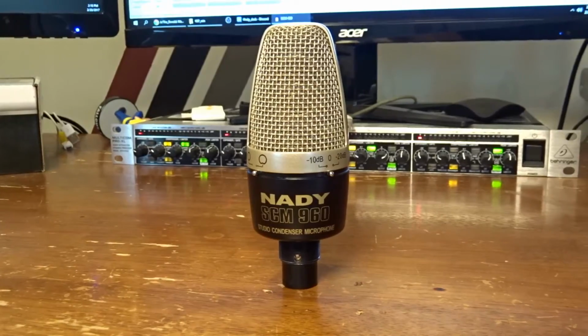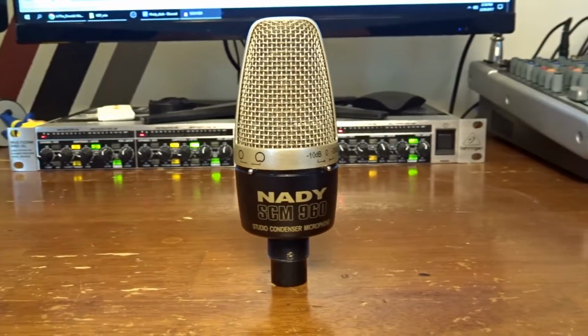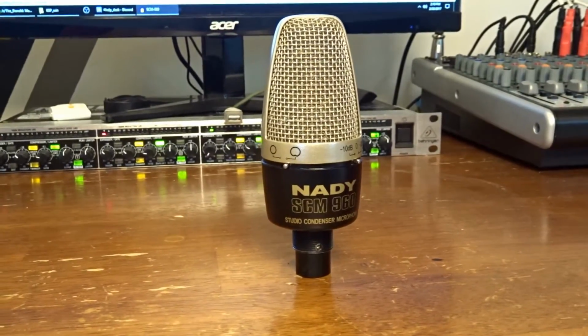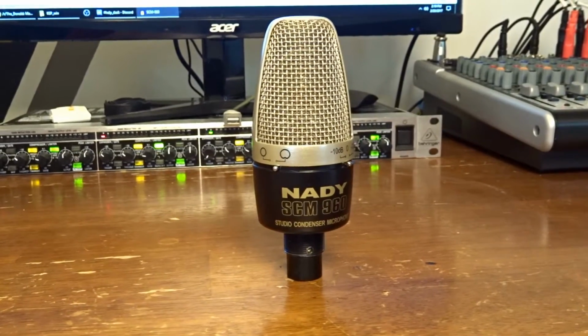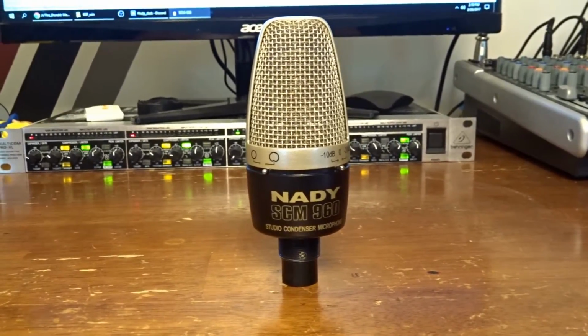In terms of specs, this guy has a 1-inch double-sided diaphragm, a 25 to 20 kilohertz frequency response range, less than 200 ohm impedance, negative 35 decibel voltage sensitivity, 19 decibel A-weighted self-noise, 125 decibel max SPL, and 76 decibel signal-to-noise ratio.